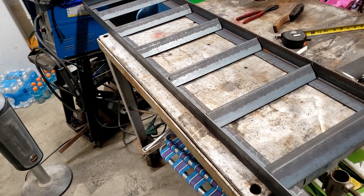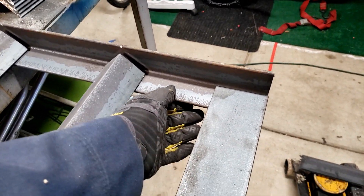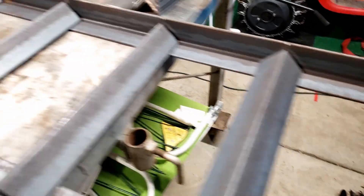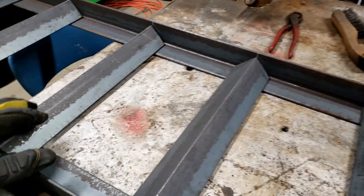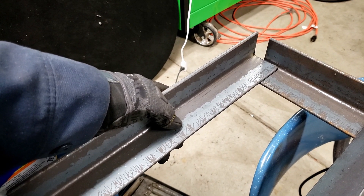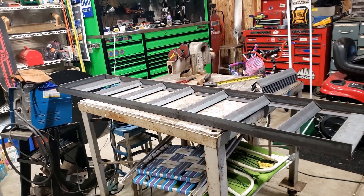So what we have here is a six-foot ramp, it's 15 inches wide. I put a little piece of flat stock here at the bottom — this is actually quarter inch, the rest is all 3/16. I'm planning on angling this edge for interface with the ground, so this will brace the end where it touches the ground. I've set my treads up every nine inches and the last one is going to hook on to the rub rail on the trailer. Now it's just a matter of squaring it up and welding it in.